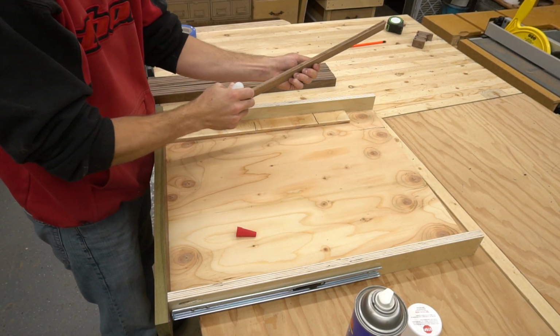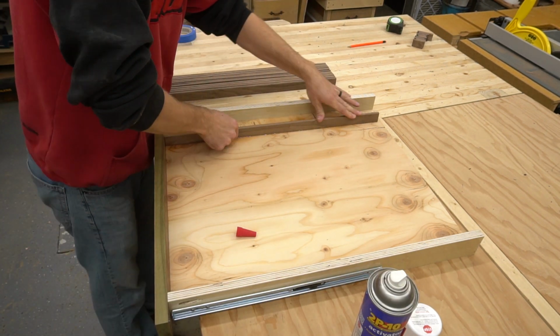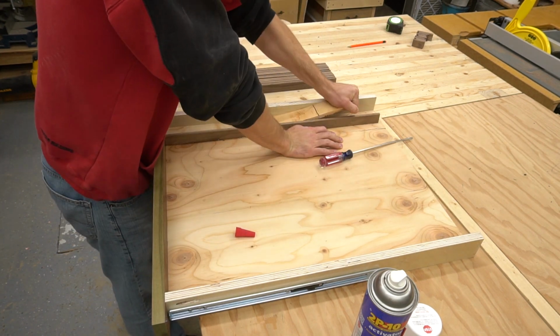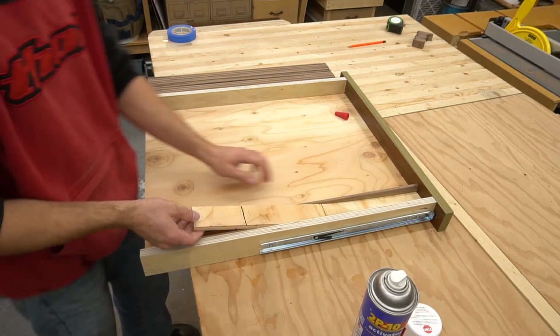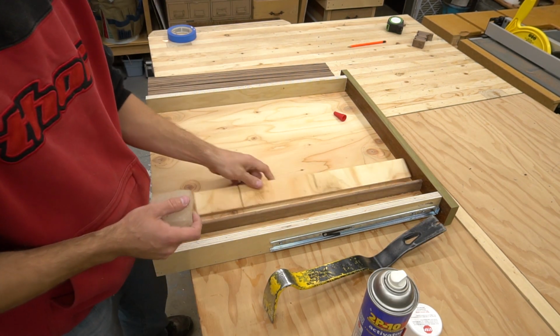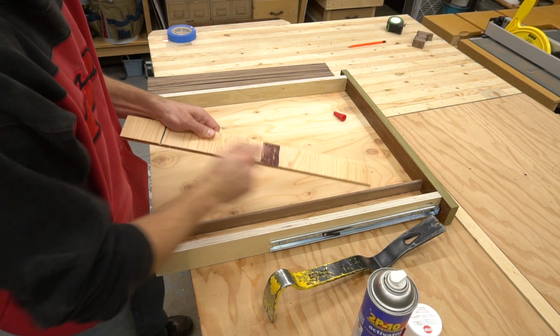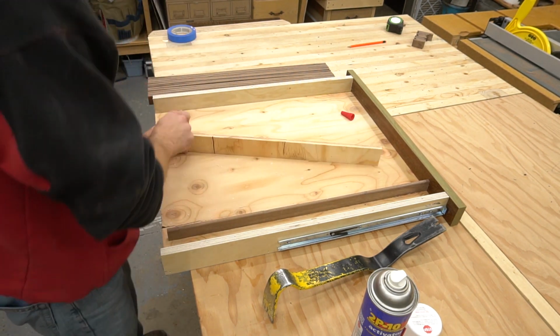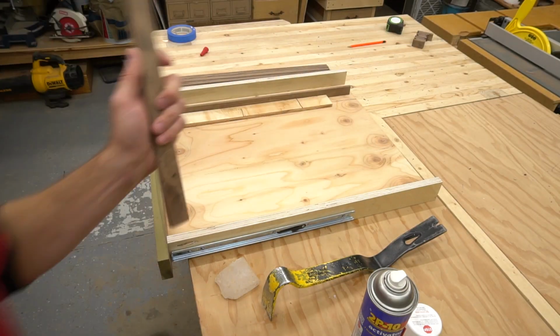I cut a 2-inch spacer, then proceeded to use CA glue and activator to glue the dividing strips into the drawer. I managed to get my spacer stuck on the very first try, but with a little persuasion, I got it back out without breaking it. To keep that from happening again, I grabbed a chunk of paraffin wax and rubbed it all over the edge that might come into contact with the glue. After that, I didn't have any more trouble.